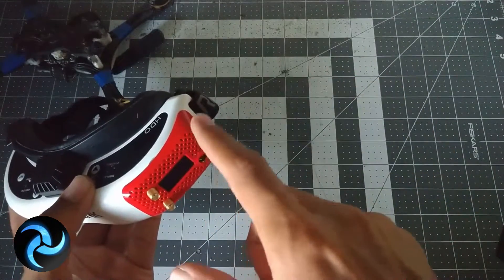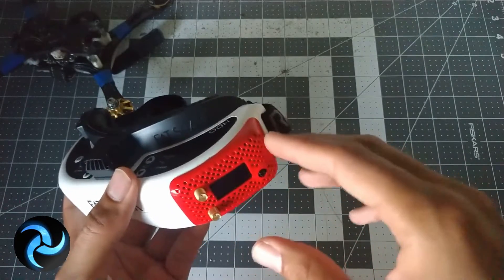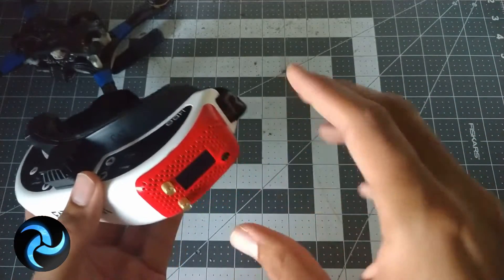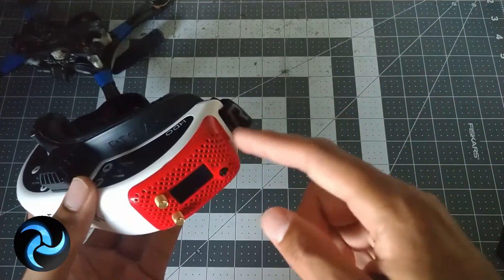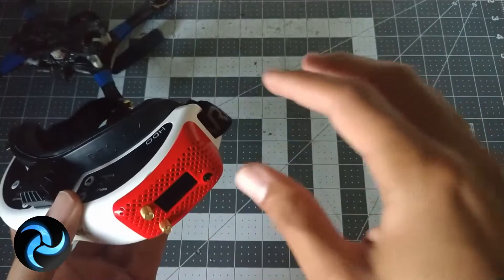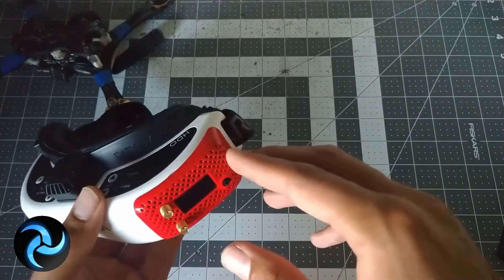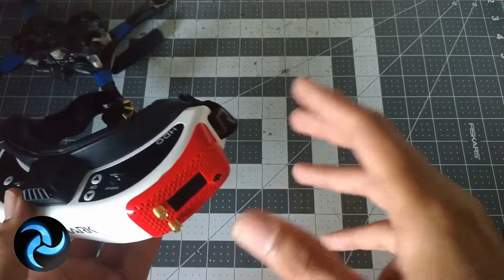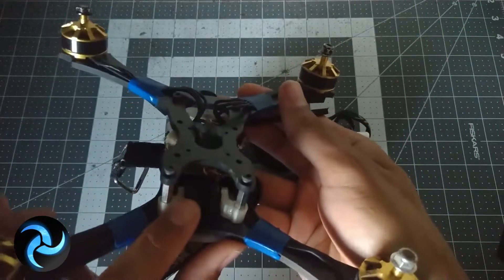How does that work in practice? There's been some information going around, and in fact ImmersionRC has put out a spreadsheet talking about this — I'll have the link in the description. They have a spreadsheet listing cameras that are not compatible. All of this analog stuff I'm talking about is why specific cameras are not compatible: they're not to spec, not giving the specified signal levels required for NTSC and PAL signals. So it's not this module's fault that these cameras are not working.